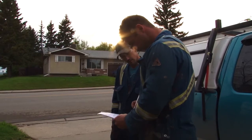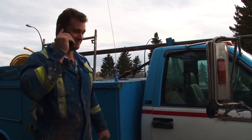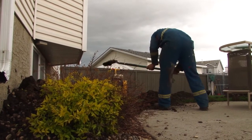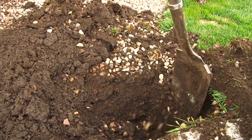I'd probably want it underground where it's safe and away from the eye. The first thing we do when installing an underground gas line is prepare for the trenching. We call Alberta One to ensure there are no existing utility lines — electrical, gas, even irrigation — that have been documented on the site. Once we have that report, we get a sketch of the job site showing where existing lines are. In those dangerous hot spot areas, we hand dig with a shovel rather than use a backhoe or trencher, to avoid costly repairs or a dangerous gas leak.